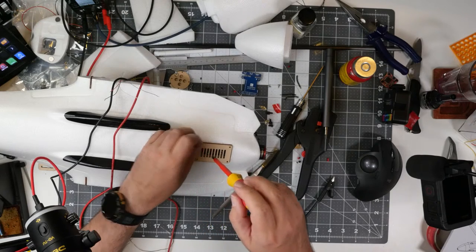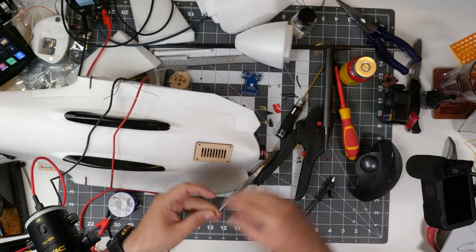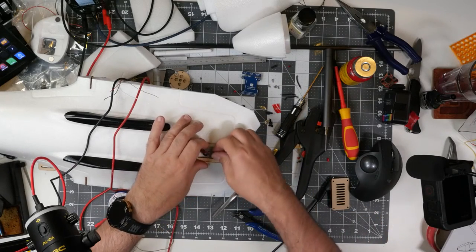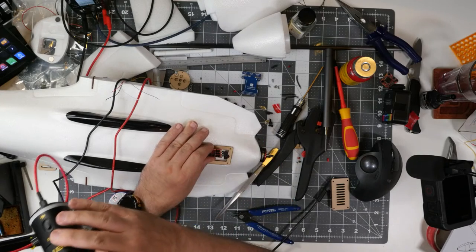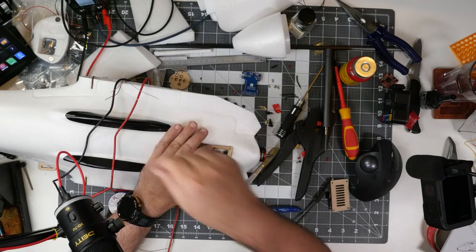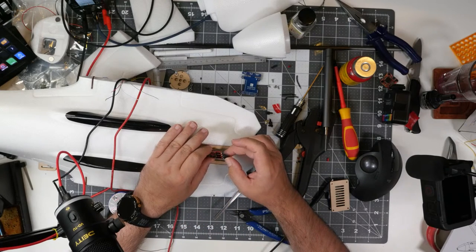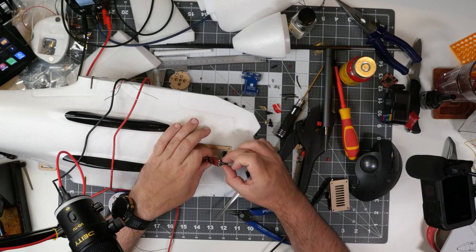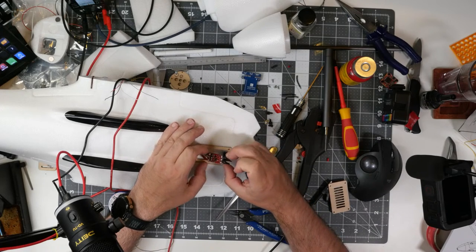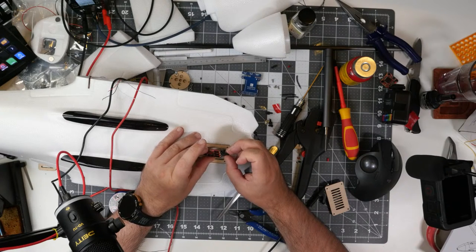And no, I don't think it's shorted. I think it just, because there's nothing to be shorted on. I think if anything happened, there was a voltage spike, because I have not installed any extra capacitor, and the power supply disconnected because of the voltage spike. So if anything happened, I think that just one of the phases, one of the MOSFETs got shorted because of the voltage spike. So yeah, that does it.